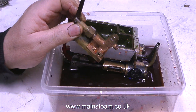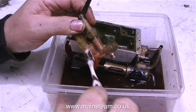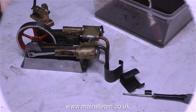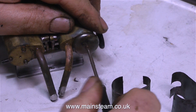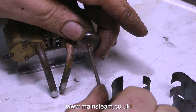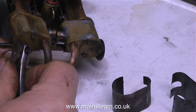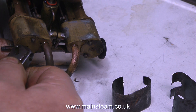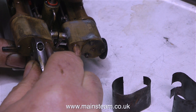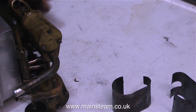Really I suppose I should wear rubber gloves for this but I don't like wearing rubber gloves or gas masks or all-over rubber suits for that matter. Please don't write in and tell me how dangerous cellulose thinners is because I'm aware of it and I try not to dip my fingers in the stuff. Now that the paint's gone I can see that I need to clean up these end caps because they're quite rusty. I'm using my small Bahco spanner — and no, Bahco spanners do not round the nuts — and I'm just checking the tension of the long bolts that hold the crosshead guide to the cylinder, because there is a bit of a leak on this side.